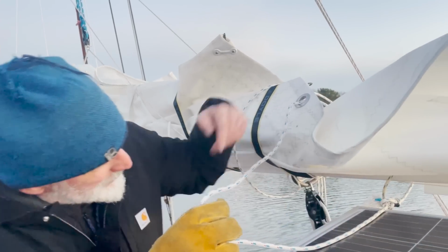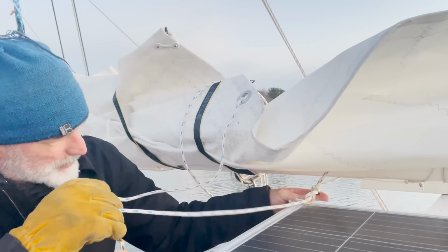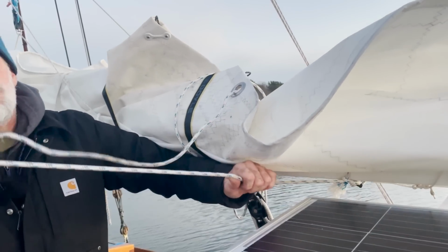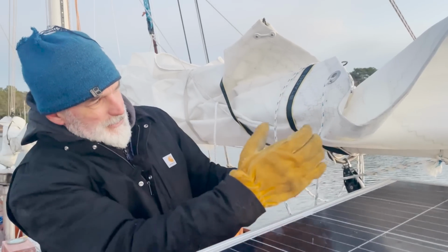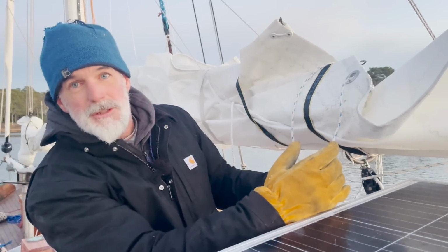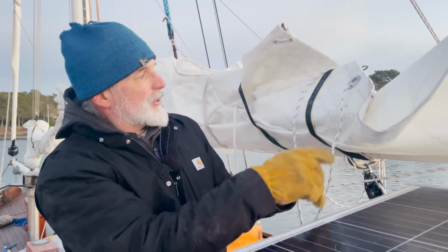and then I run over the boom, and then back around the boom and tie a loop in it, so you can tighten that up, and it will sort of luggage itself onto the boom, and it won't slide along the boom. You can move it forward and aft to get the right position, to get the right combination of downward pull and outhaul pull.